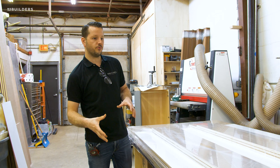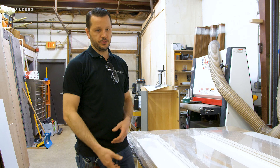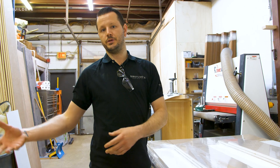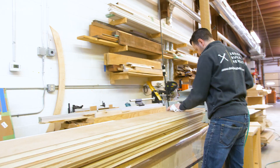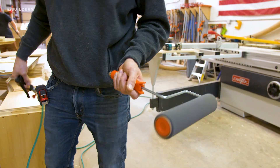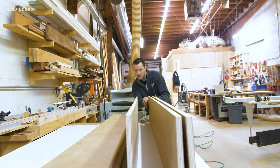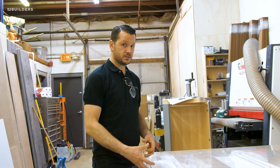To glue up the uprights for these bookcases, we're going to start by taking our rips which are left wide so we can go back and trim them to size once done. There is going to be a little bit of shifting that happens and the pieces aren't always going to be super flush, so we want room to trim them later without compromising our end size. I'm going to clean off all these pieces and make sure there's no debris between our layers so they sit flat and tight — we also don't want any dust in the vacuum bag. We want to sight down our pieces and see which way the bows are going, making sure bows are going in opposite directions so they help keep the pieces straight after glue-up.